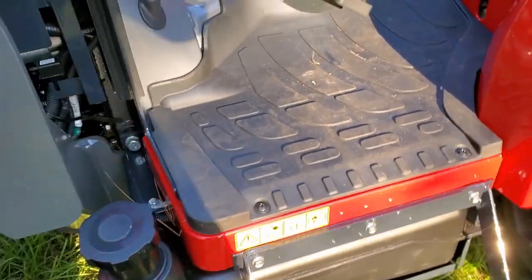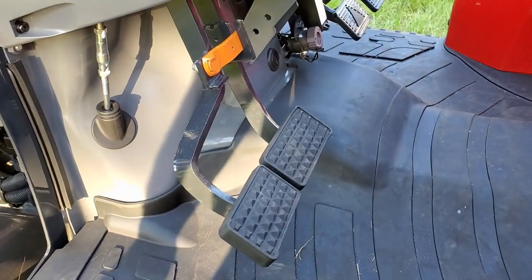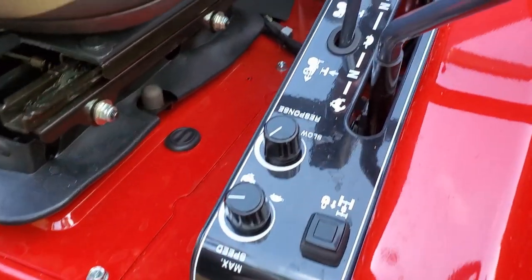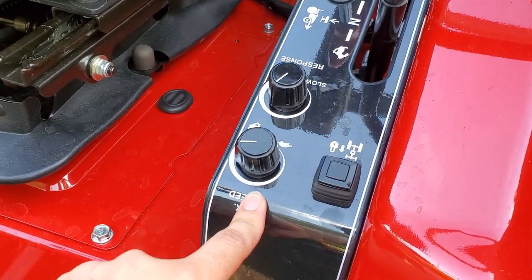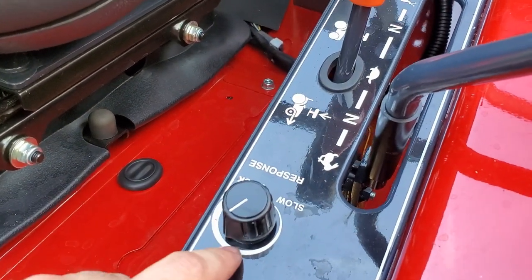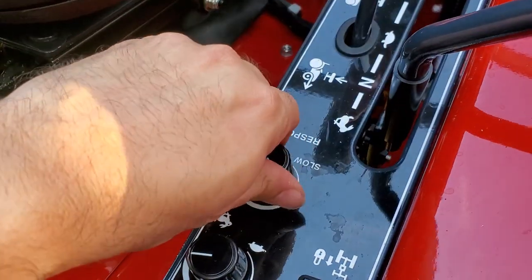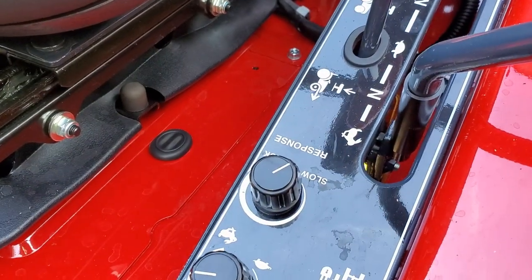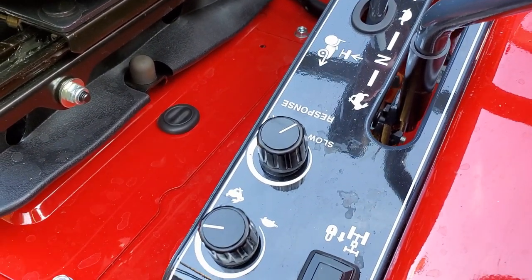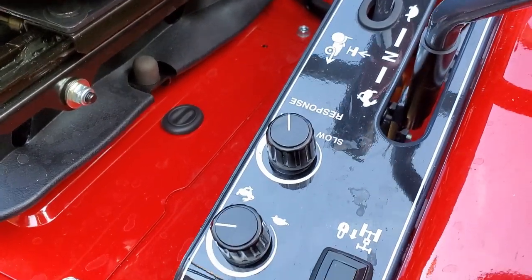Here's the ECU. This unit comes standard with a deck mat and separate brake pedals that can be linked. You have cruise control and you can set the max speed of your hydrostat regardless of which range you're in. You have a response control — if you let off the hydrostat pedal while it's in slow, you can drift into a stop or slowly accelerate. Vice versa, if you put it in quick, it'll stop and accelerate instantly.